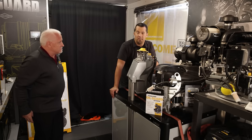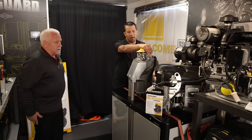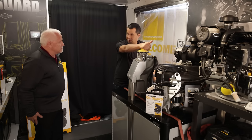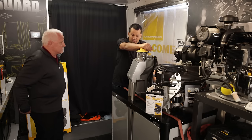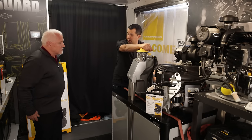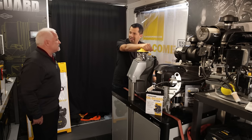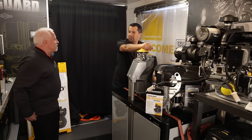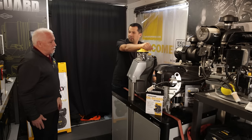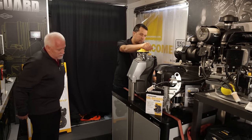That extended oil change is an interesting thing to think about because so many of the people who are buying this equipment commercially put on huge amounts of hours and can hit those intervals really quickly. But even a lot of residential people too — is it okay to do every two or three years? We recommend that you do it probably once a season. Typically you're not going to get 500 hours out of your other fluids that are in your engine. So once a season is usually good to do it. When you drop fluids, drop everything.